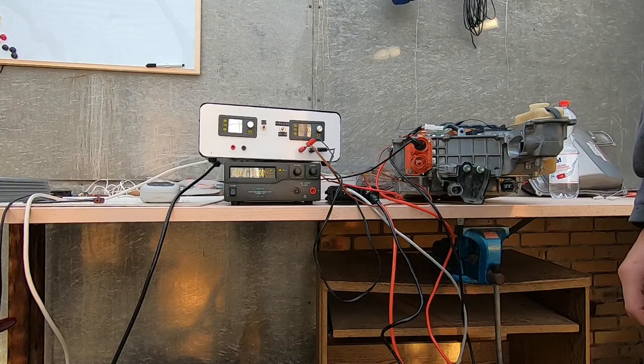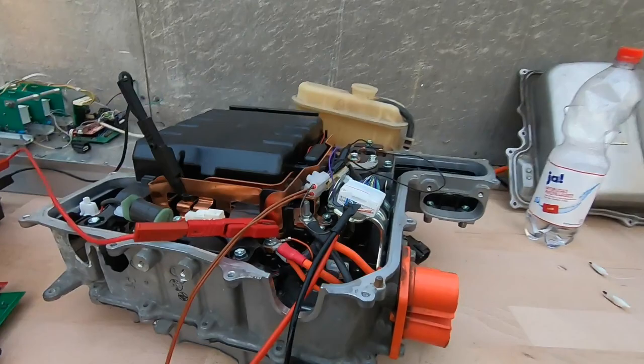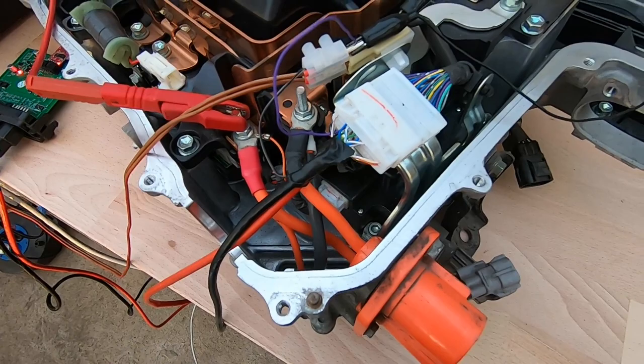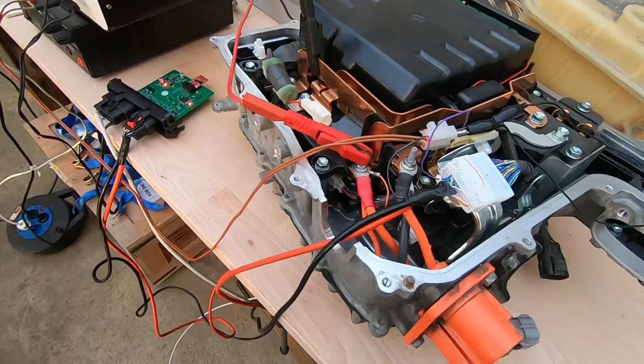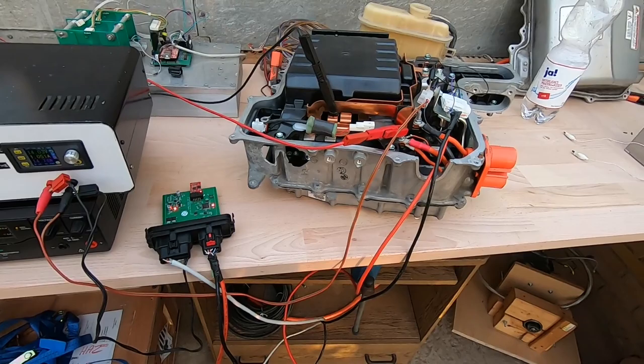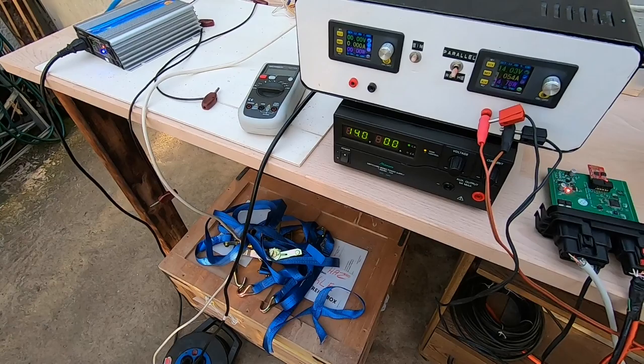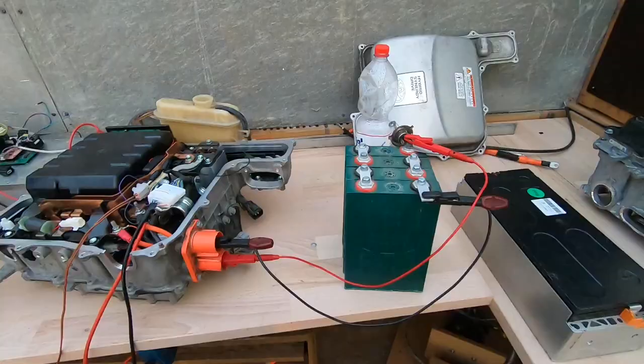Let's look if we can solve this. This was quicker than I thought because I had found a converter shutdown signal earlier and I've just brought it out on this pin, and I have now connected it permanently to 12 volts. I've connected the power supply back here with a shorter wire. And we're good — we're not short circuited. As soon as we pull it out, back to short circuit; put it back, no short circuit.